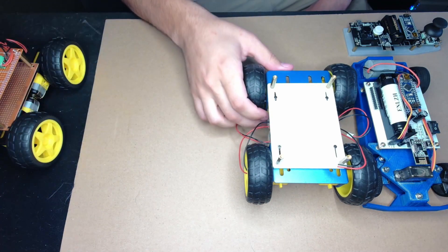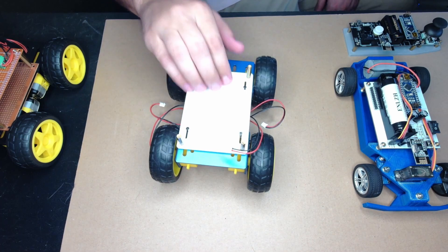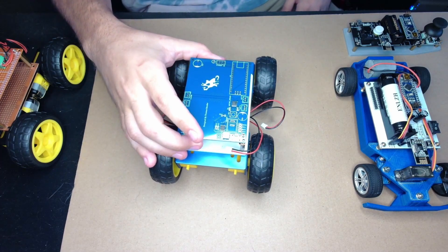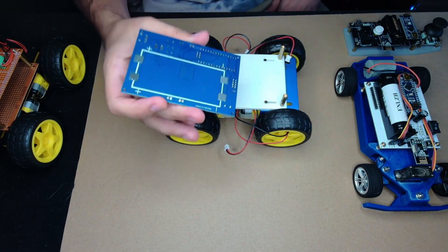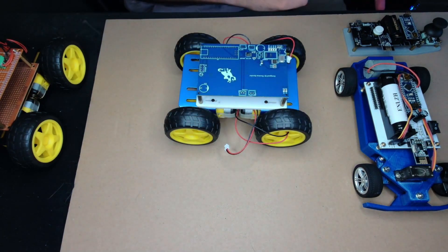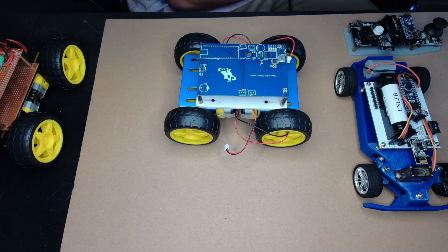From there, I went a bit of a better route. I have a PCB design for this one. So for this board, this is a PCB without anything soldered onto it, like the Nano and the NRF. This was meant to mount on there, right on these posts. It held a dual 18650 battery pack on the bottom, in parallel, which as it turns out was way too much — I didn't need that much battery. This was cool, it was a bit faster, it worked. The idea was to take this project and pitch it to be some sort of class at a technology camp, which did eventually work out, sort of. I'll get into that a little later.